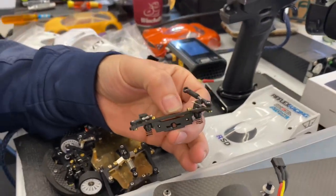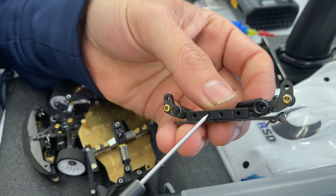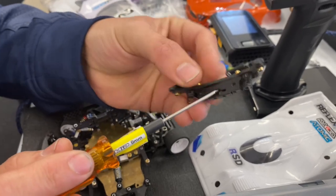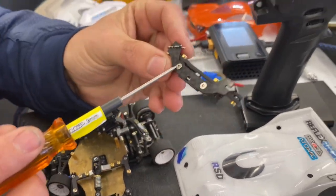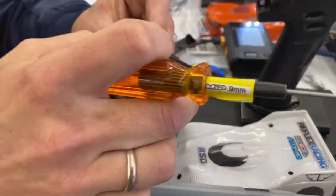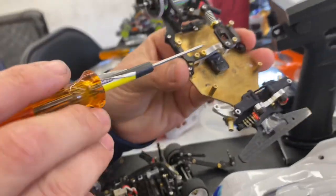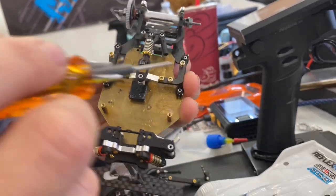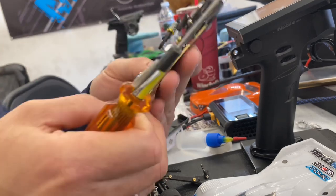Here's the pivot — we've got our slots and these are through holes that are threaded. You mount the screw on the top and you've got your little screw holes right here — that's how you tighten the pivot. It's a cylinder, it's Delrin so it's super slippery, and it's a one-piece mount for your shock brace. It's super light. These will be slotted so you can pull this out — probably do it mounted by just taking off the shock mount — and you slot this up and down to adjust your body mount height.